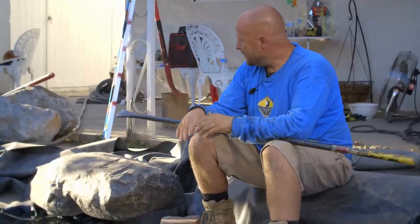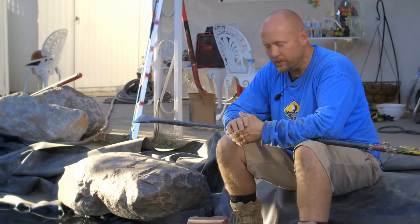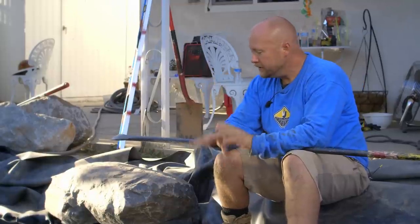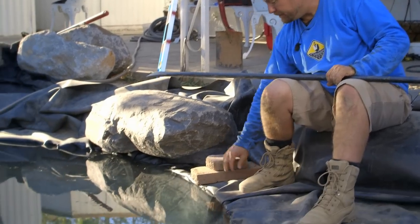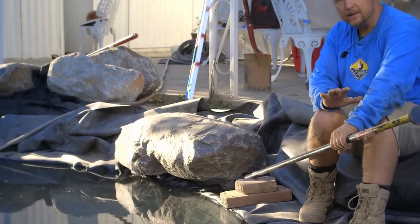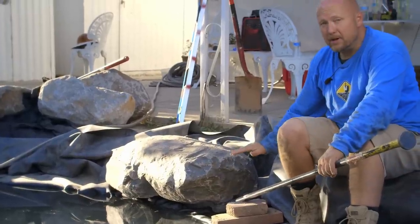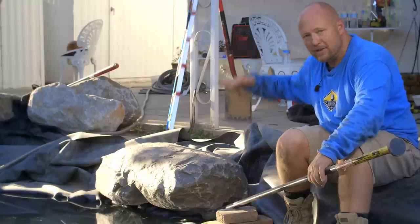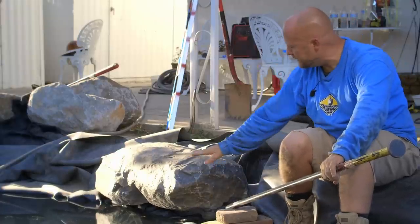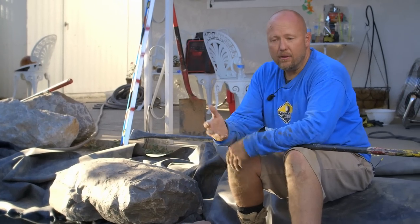I want to explain what we just did. This is a do-it-yourself pond — we're not talking about using machines. This is about as big a rock as we can easily manage with two or three people. I have this leverage bar, and when we put the big rock in, you see it kind of pushes the wrinkles towards the pond. To get them out, I put just a couple bricks down with underlayment below, then used the leverage bar to easily lift the rock so we could pull the liner from the back and pull that wrinkle out. We also put fabric on top of the liner to cushion it as the rock sets down. A bar like this is going to be important if you're using big character stones — otherwise you could do it all by hand.